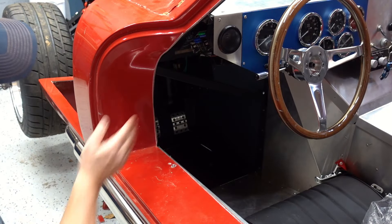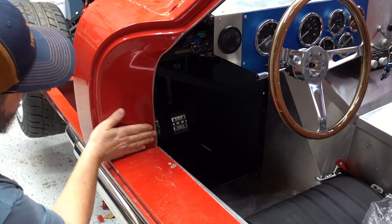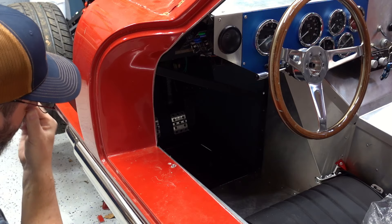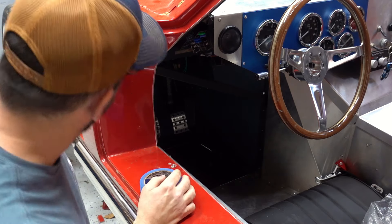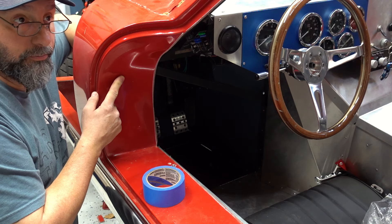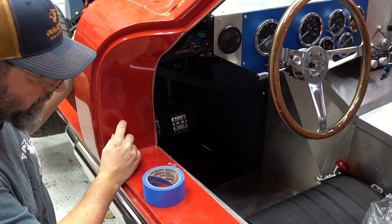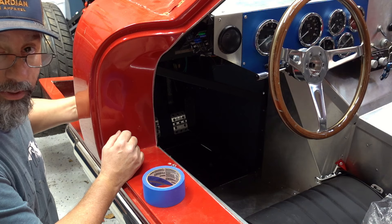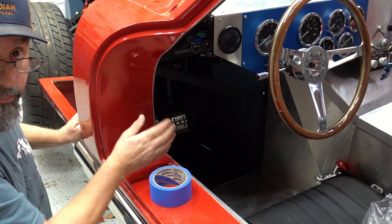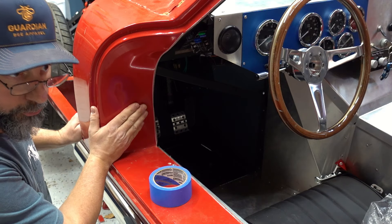Alright, so I've got the hinges on. The next thing they want you to do is put some masking tape — or I'm going to use painter's tape — all in here. Then we're supposed to mark like a quarter inch in all along here. I'll double check that with the manual. You should too — don't ever take my word for it. And then from the other side, we're going to make some really small holes and drill through kind of where the two hinges are, top and bottom of each one. That way you've got reference points on this side so you can make these cutouts so the whole hinge system can go in. I'm going to put my marks on and get those holes drilled, and then we'll come back.